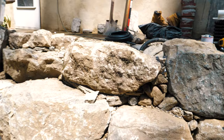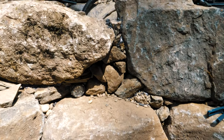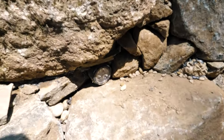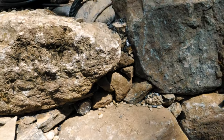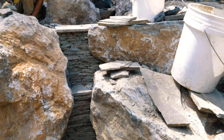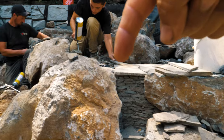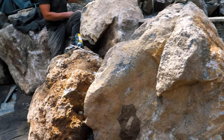While all that's happening, we're working in things like lighting. Our lights are in there the way we always do them with our chases — our wires go through chases to hubs. If there's ever a problem with a light, we can just pull the light right out of the cup, tie a string to the other end, and pull a new light back in. We set these large boulders coming out from our constructed wetland area. If you watched part one, there is actually a block retaining wall behind all of this, and you can see how we've disguised it with all these big boulders.